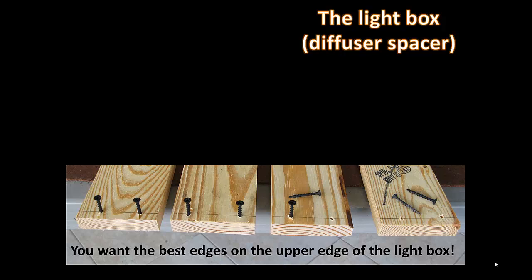Now if you do not have corner clamps, which I did not have in the Dominican Republic, you can follow one of these next procedures instead. Mark the ends of the boards where the screws will be driven, as you see here. Drill pilot holes, 2 in each corner overlap, but do not put the screws in yet. Now hold the corner together while keeping both boards flat on the surface, and then slide the drill bit back in while holding the corner even and square and tight, and drill at least a 1/4 to 3/8 starter hole in the end of the receiving board.